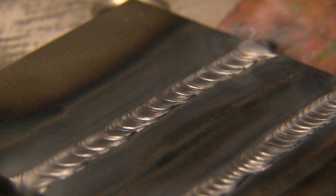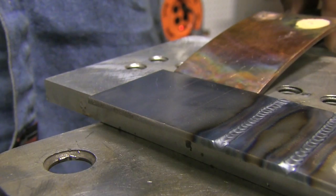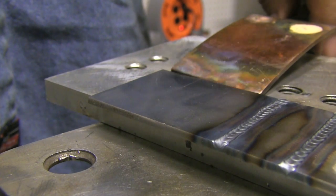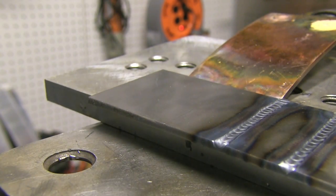Now let's weld to the copper spoon. I've got that piece of copper on the end of the copper spoon on the edge of this weld. When I get to the end of the piece, I move the arc over — you can watch that puddle solidify, make a little point on the end, it maintains shielding gas, and you get a lot better result than just snapping out and leaving that little bit of oxidized metal that you then have to go back over with a file or grind.